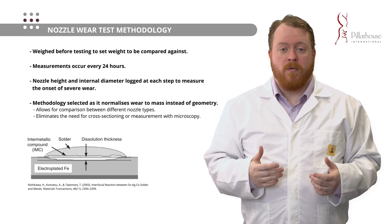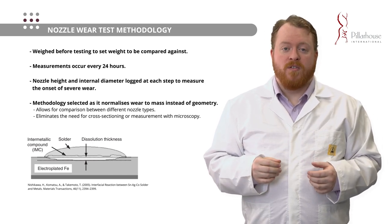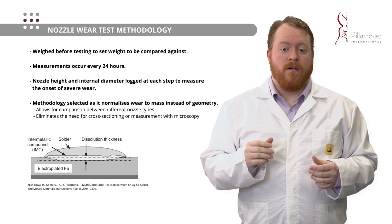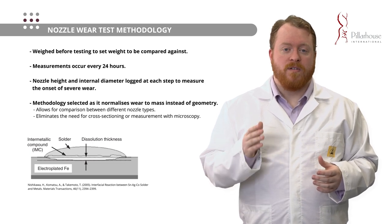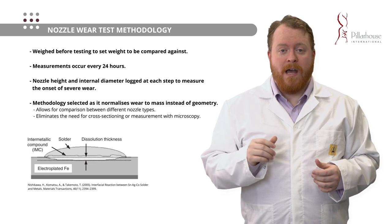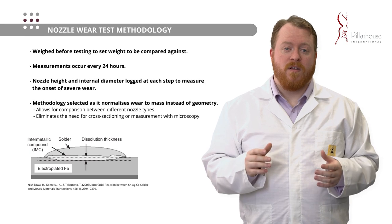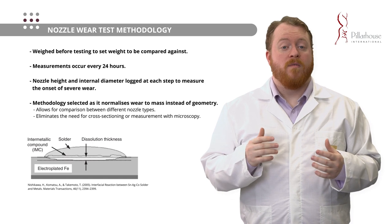In the past we've seen people look at a dissolution thickness — where a large solder drop is placed on a material, then the material is cut into and analyzed with an electron microscope. This is quite difficult to achieve because it requires cross-sectioning to be done with the same process every time and is very poorly defined in terms of dimensions. Mass loss gets rid of all of that: we instead have just one metric we can use, and with repeat tests we can have results with very low error.